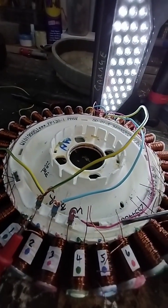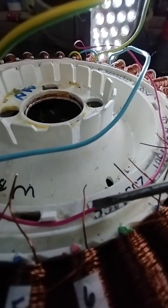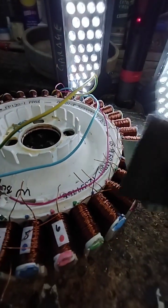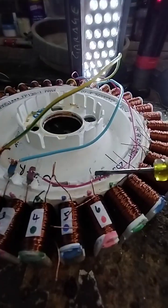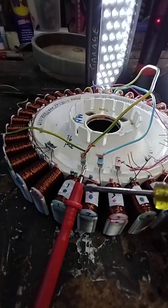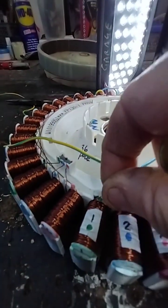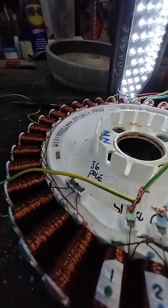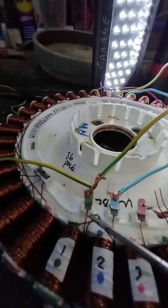Remember to join this wire: peel off the enamel coating — which is the insulation — between this point and this point, and wind that wire in. Once you've peeled off the enamel with your 320 or 400 grit aluminium oxide sandpaper, wind it in so you end up with green to green, blue to blue, red to red. Those three left hand sides are twisted together and we'll pull it out, place it against the white background so you can see it a bit better.